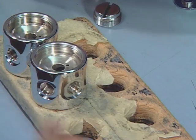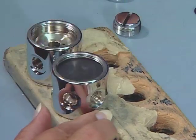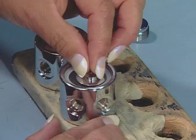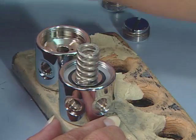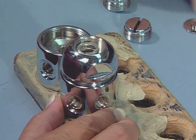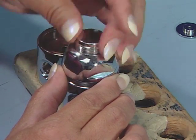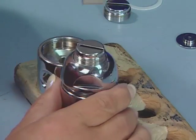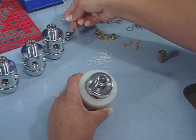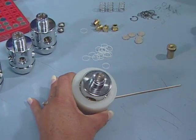A worker carefully assembles a diaphragm-type first stage. This design prevents water from entering the mechanism with a diaphragm that balances tank pressure to the ambient pressure. The high-pressure seat assembly combines the seat, filters, and retaining clips in one unit.